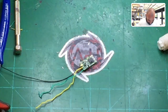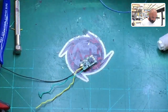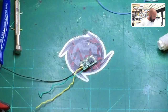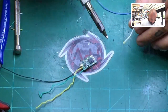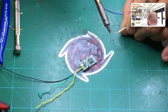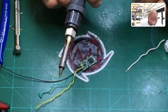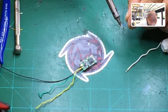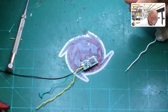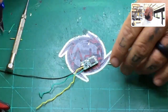I'm going to go ahead and get ready to solder up some power wires — just a real quick test. I'll use a white wire and strip it, then tin it. I'll do the same with a blue one. This is just to test things out and make sure everything works. Now I'm going to cut back that wire because it doesn't need to be that long — I risk shorting this out if I don't.